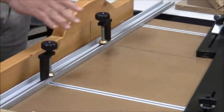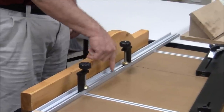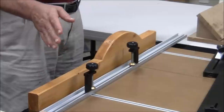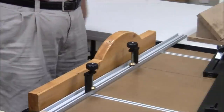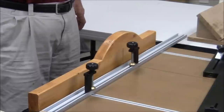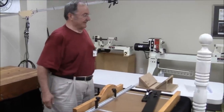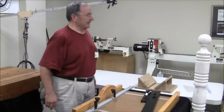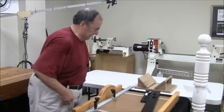I proceeded to slide the thing across the SawStop. As soon as the blade on the SawStop saw this piece of aluminum, even though my hands weren't touching it, there was enough of a capacitive discharge on there that the module fired, and God, let me tell you how quiet it gets. I thought, what went wrong? Then I figured out how sensitive those things are. So we had a new trophy to hang on the wall, yet another example of what a SawStop will do.